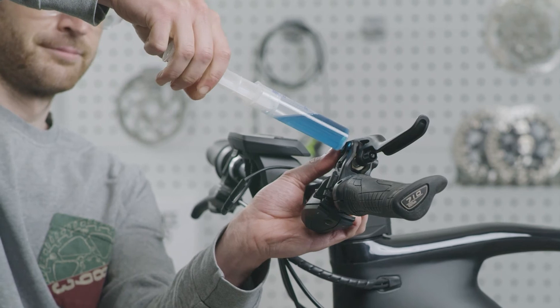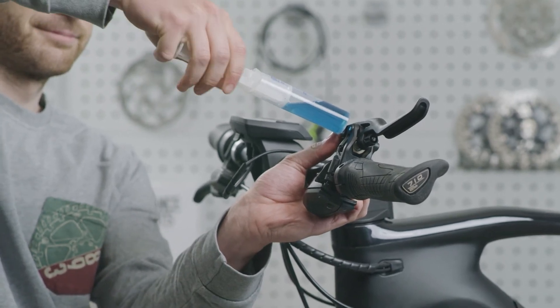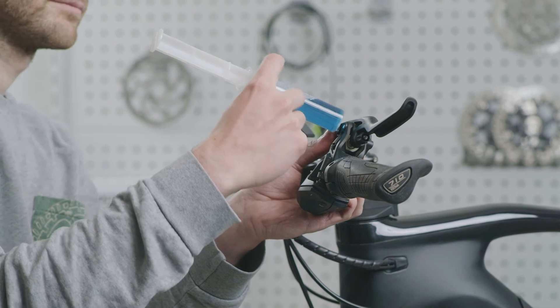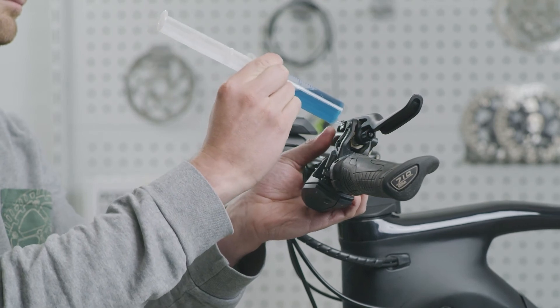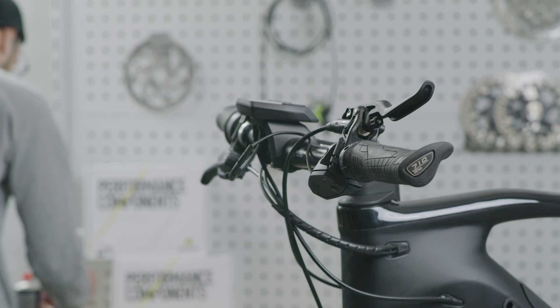As a last step, pull the plunger over the hole. Wait for a moment until the oil level drops. Push the plunger under the hole again and then pull it for the last time over the hole. Again, wait for a moment until the oil level drops. Block the hole with your finger and pull off the syringe. This prevents oil from escaping.